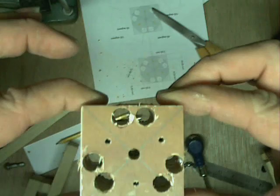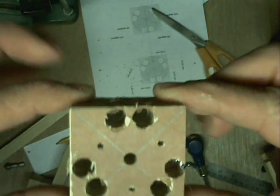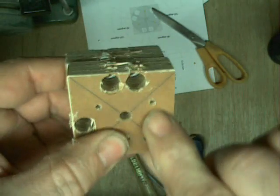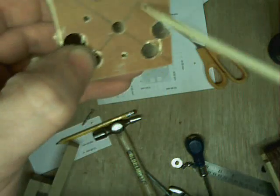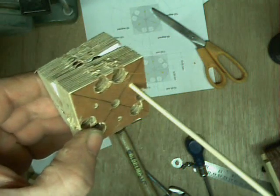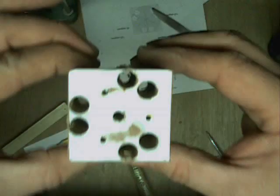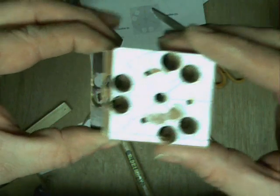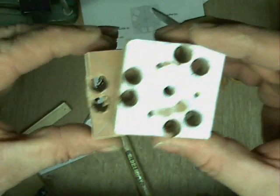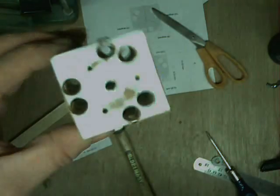There you are - my block all drilled, as you can see all the way through, and there's the other one behind it. So you can see that they're exactly the same. These here aren't wasted - these are actually to shove little bits of dowel through, glue when we glue them, to lock them all together while the glue's going off while we compress them together. So these are also a part of the build. As you can see, all drilled, all three - perfect alignment. Now let's go on the next bit, I'm rounding them off.